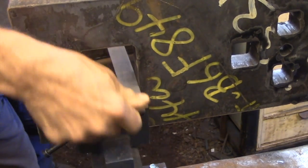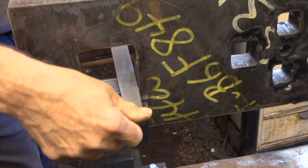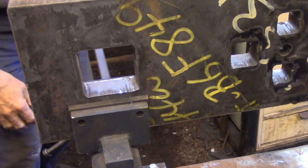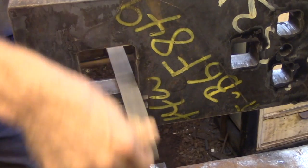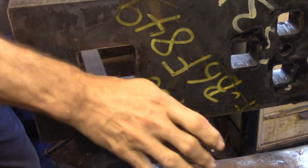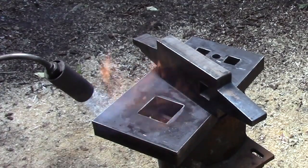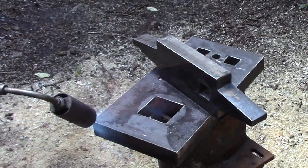As it turns out, the plasma cutter tends to heat treat the edges of the cut because it heats and cools the material so quickly. This is mild steel and there isn't enough carbon in it to make any tools, but it still heat treats enough to be a nuisance and the file is basically just skating across. So I have to heat up all of this metal and draw the temper so that I can get the file to bite into the surface.